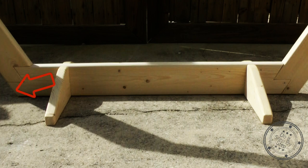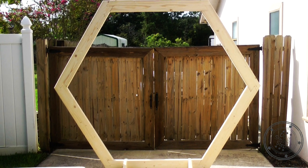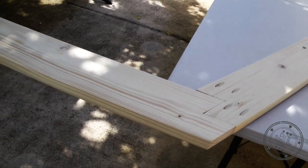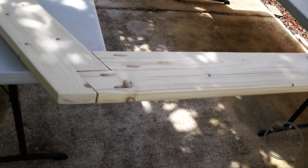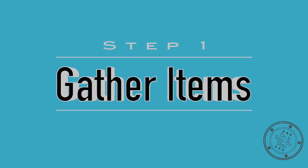It is also important to note the layout orientation of each piece. You will have one exposed end grain and one covered end grain. There are two reasons for this: it helps the hexagon keep its symmetrical shape, and provides a location for the pocket holes to be drilled with the grain of each piece. This will make for a stronger joint because it allows the pocket hole screws to engage with the edge grain of the other piece.